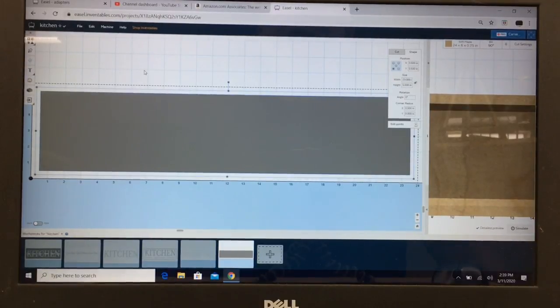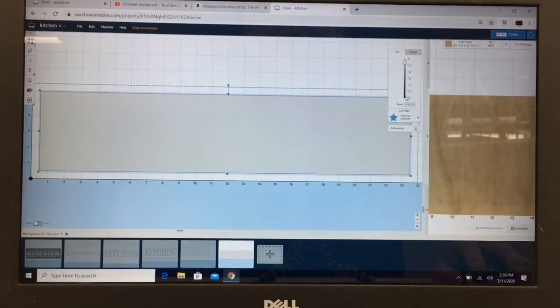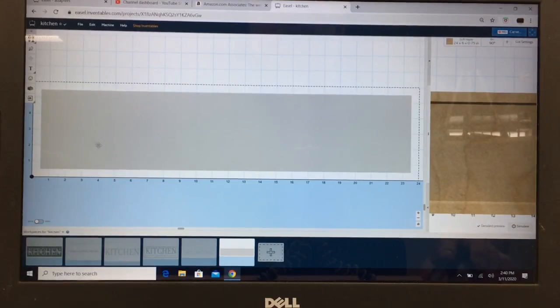The last thing you have to do for this is set the depth of the cut. Click on the cut and change this to 0.1 of an inch. The biggest problem I see people do is they try to carve too deep. Now 0.1 of an inch actually is fairly deep. You can make this really anything that you want — it needs to be fairly shallow. The shallower the better because it reduces carve time, so long as you get the desired end result. So I'm going to go with 0.1 inches deep. Layer number one is finished.